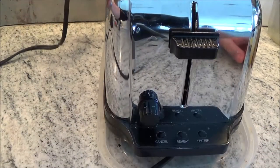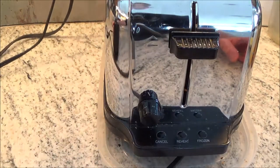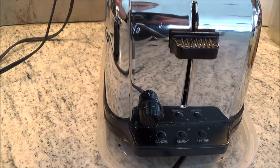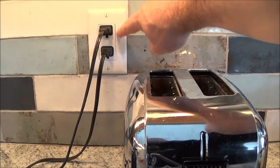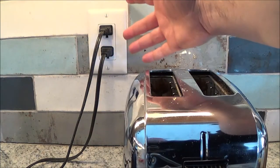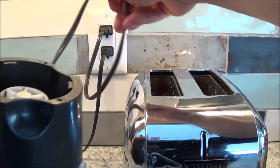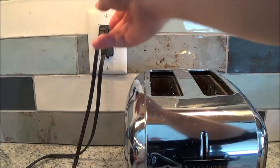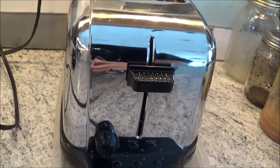First thing we do is check the power, and we can see it's plugged in here. That's working. But you have to check both plugs, because in most building code situations, kitchen plugs are split — you should have two separate 20-amp circuits, for the very reason that if you plug a toaster in one and a blender in the other, you're not going to pop the circuit breaker. We know the top one is working, so let's put the toaster up in that one just to make sure. And no, it's still not working — so we know at least that plug is getting power.